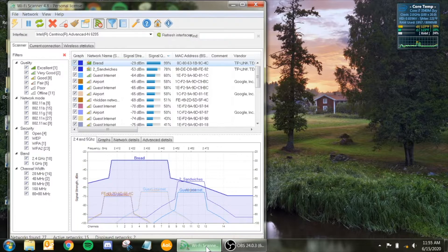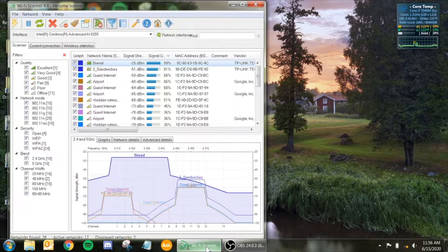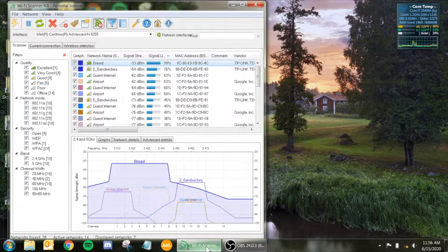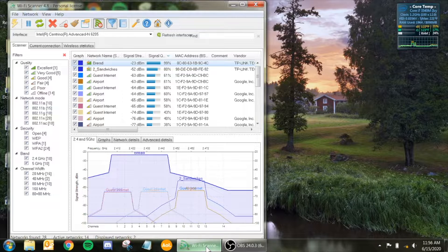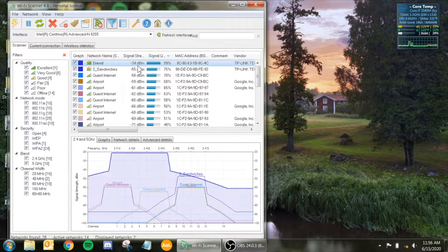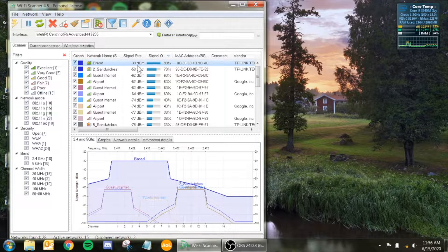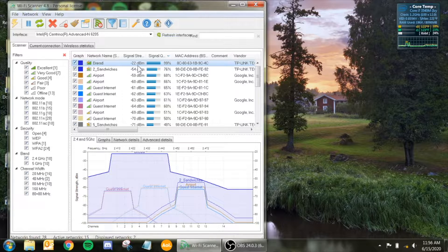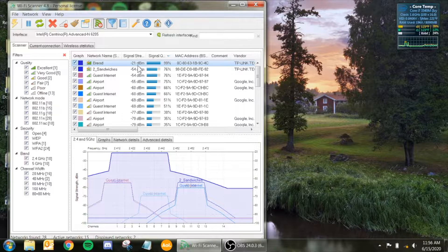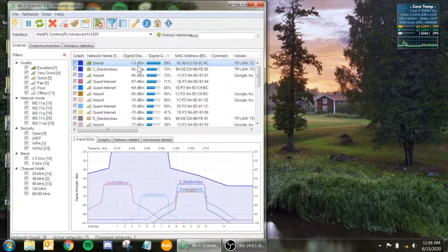Okay, I'm recording from the computer now. Right now I'm downstairs about two feet away from the transmitter and we're getting about negative 30 dBm signal. I don't understand why this is so noisy — when I was upstairs before setting up that other TP-Link router, the noise floor was only about 12 or 13. There are only two cordless phone handsets down here, so it should be a clean environment.